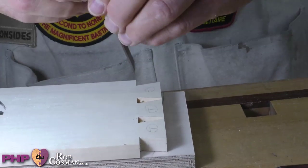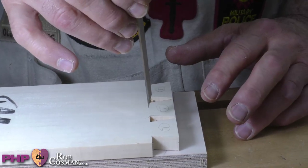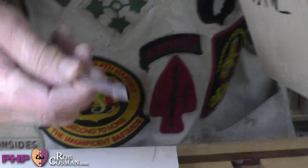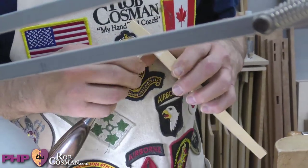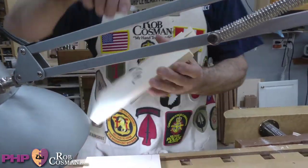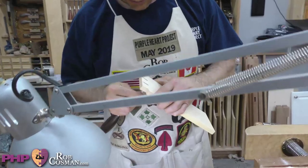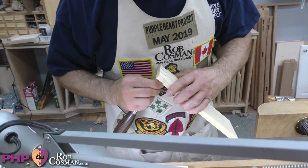What I mean by leave a bump is your chisel is positioned like this. That's an extreme, but even if it's just a little, any bump left in there at all is going to prevent the joint from closing properly. Now you've got to go in with a chisel and somehow sitting just inside, carve all that out. Totally unnecessary because you just had to have done it right the first time, which is hold your chisel either plumb or slightly undercut. Not a lot, slightly. I'm going to make sure that I don't have any material left in the corner.